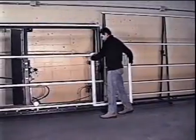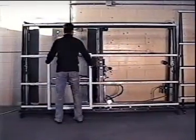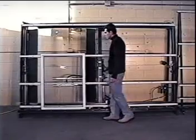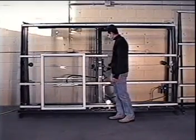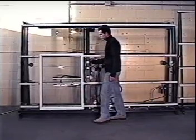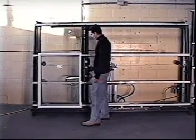Let's see how the entire process works. Gliding the window along the transfer conveyors, the window is moved into position. The optional retractable stops are flipped back into position. The brake is now released and the squaring member is moved to the next jam and pressure is activated.